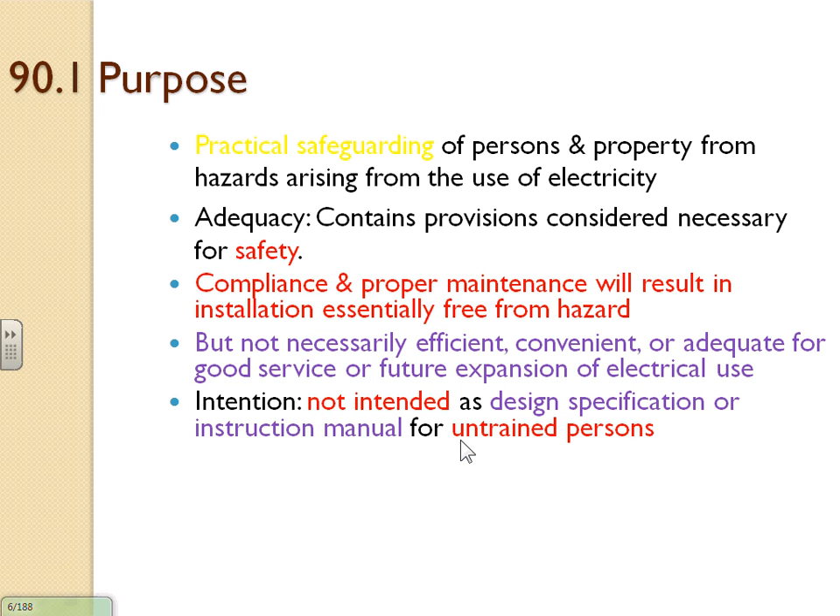We lay out the cables, run a short-circuit and load-flow analysis, set our relays, and that becomes our starting point for cable and equipment sizing. The purpose of the NEC code book is the safeguard of people — safety is the main reason. As engineers, the NEC is your reference floor. How much higher than the NEC you go depends on how good a design you want to produce.